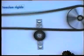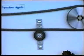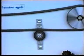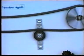A simple, rigid sprocket compensates the slack as long as it is always adjusted according to the degree of chain elongation. Without adjustment, the chain starts to vibrate and favors an early wear out. The rigid sprocket is not the ideal unit for length compensation on chain drives.